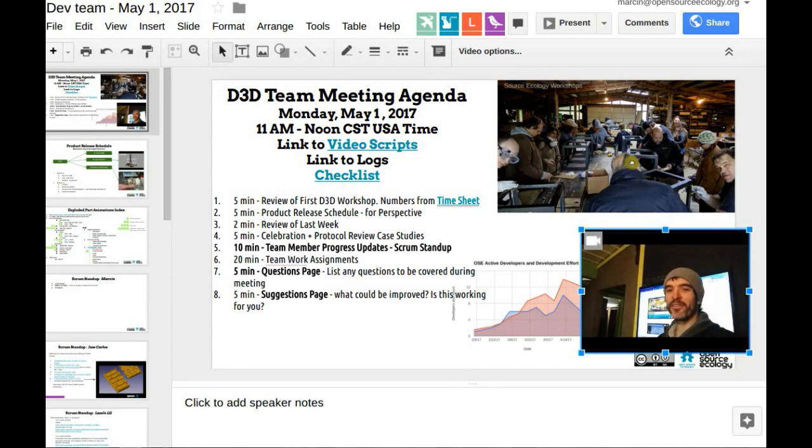Good news being that even with totally unstraight axes, like one guy just slapped the stuff on and we didn't pay attention where everything was, and you can visibly see that it was slanted by 3 or 5 centimeters on one side of the axis, it's still a perfect print because of the height calibration, the automatic sensor, which was pretty amazing.